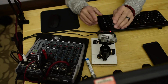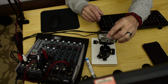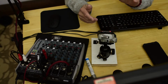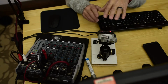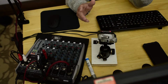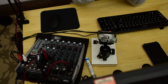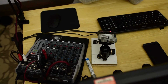This also comes with, by the way, the external mics that are built into the H4n itself, and you can use these like in a live application, or if you're out and about and you wanted to do some field recordings. These work great. These are very, very sensitive, so just keep that in mind. I don't think those would be good for a podcast setting, maybe an on-location interview type with somebody. But again, they do pick up a lot, and they are kind of harsh when it comes to everything they pick up. And they're not harsh, they are what they are. They're just built-in microphones that you can use in a pinch.